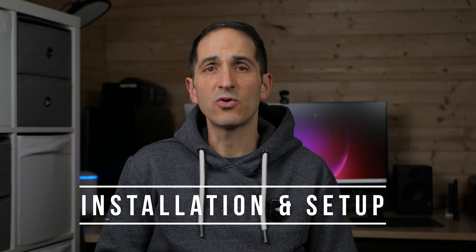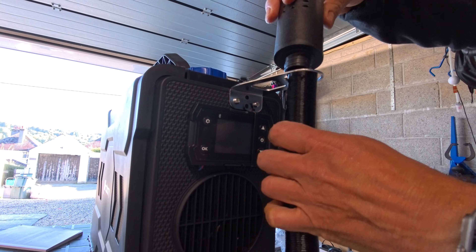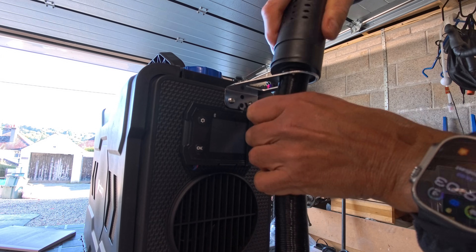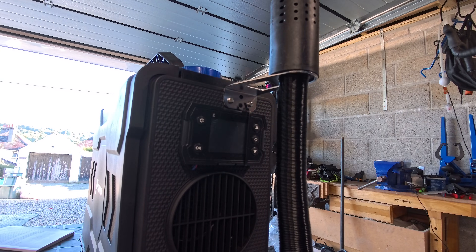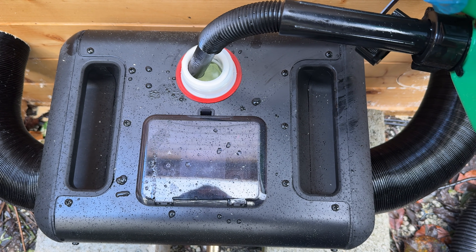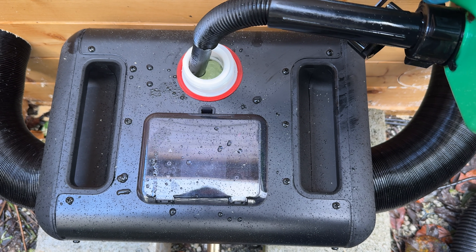You can install these heaters inside or outside your space. Inside will heat your room slightly quicker but it's a little more involved — you need to pull air for the combustion chamber from outside and run the exhaust outside too. There is also more noise running them inside; the pump makes a clicking sound, though they have got quieter. One of the models I've been testing has an almost silent pump. Also filling the tank with diesel can be smelly — I personally wouldn't want that in my office space. There are safety concerns too, which I'll discuss shortly.